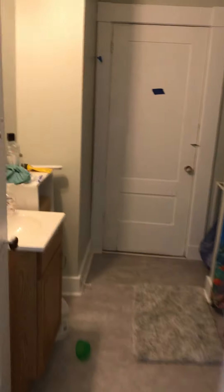I did do the doors — they came out beautiful compared to what they were. Remember in the previous video how I said I had to redo this door? This door was in rough shape. The trim came out nice — cashmere semi-gloss, primer, two coats. All I did was sand it, and a little trick of the trade: I filled it in with Plus 3.